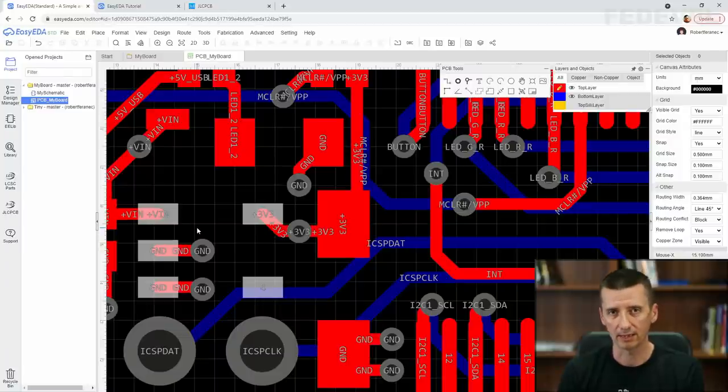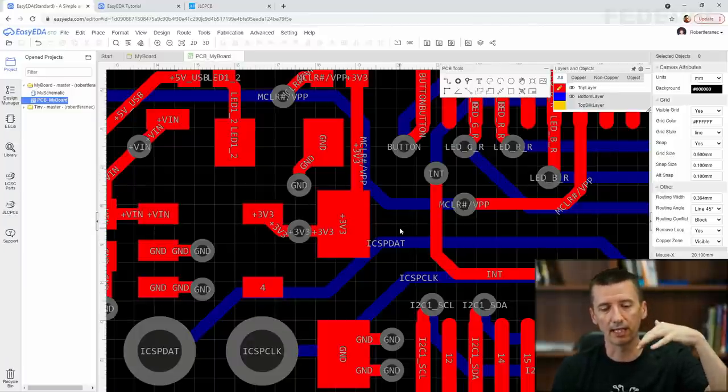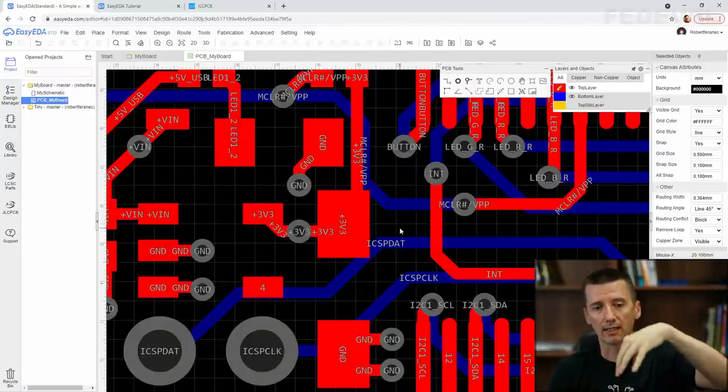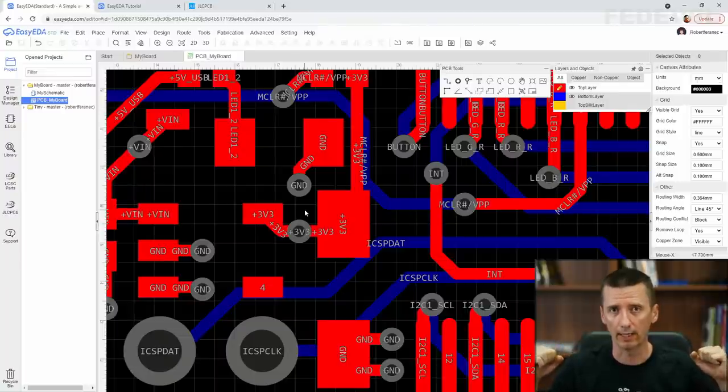You don't really need multiple vias, but it is good practice. So when you are designing your own boards, you will remember, oh, I'm doing layout for a power supply, maybe I would like to use multiple vias. Multiple vias can help with power dissipation in case this LDO gets hot. If you have multiple vias, then the heat can go inside of our board and spread on layer 3 where we are going to have a big power plane.